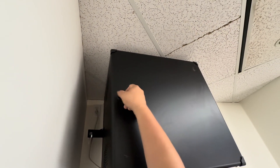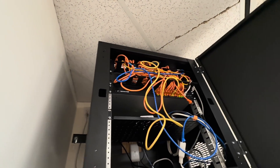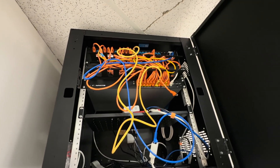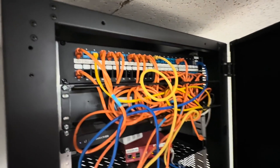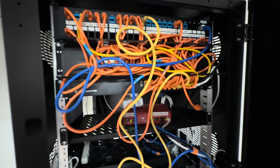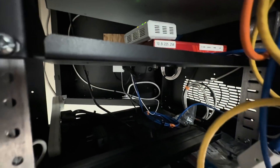Now for the current contents of the rack, I'm looking at the patch panel, the cable manager, and the switch. Obviously the patch cables are a disaster, but that's par for the course everywhere I go. The real thing about this cable manager that kind of bugs me is that there's literally nowhere to put any kind of slack. I'm just going to take this thing out — it's wasting space. If I want to add 50 more cables here, I need to add an entire other panel and an entire other switch. So my plan is to collapse all of this as small as possible and use very short patch cords to make this whole thing work.